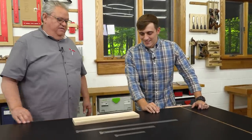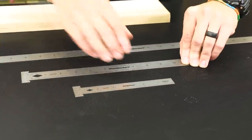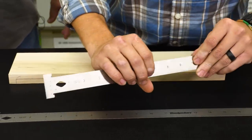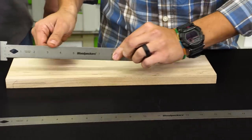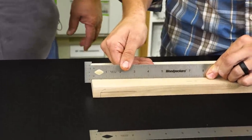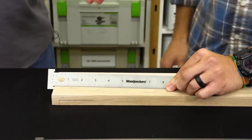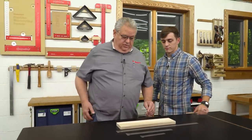So Jay, what's your first impression of the hook rules? My first impression is pretty obvious — it's the hook. We've got a hook at the end of a stainless steel rule, and the advantage of this is an instant zero reference every time, super quick. Place it on your board, pull it so the hook touches the edge of your stock, and there you go — instant zero. You know you're always registered off the edge of the board.